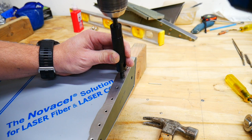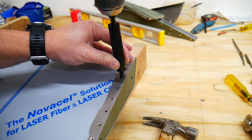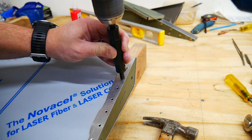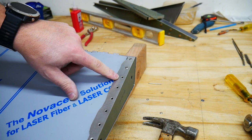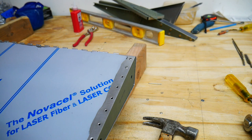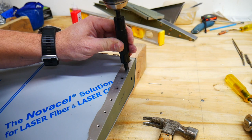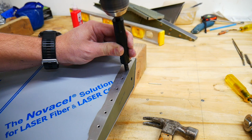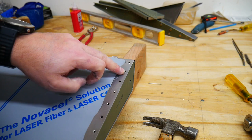Put this on high speed because it doesn't catch as easily. I'm holding down on this part and slowly going to introduce the drill once I've got it spinning. There it is — the rivet head did not spin, and it didn't do any damage to the outside. If I grab another rivet here, I should be able to just re-rivet that like before. Let me do another one. I'm holding down the bigger shank part and slowly introducing the drill bit to it. Again, no damage to the skin because the rivet's not spinning, as a result of using this tip piece here.